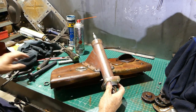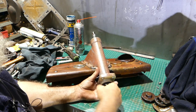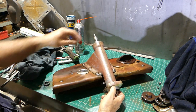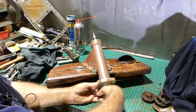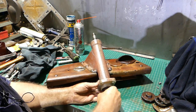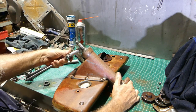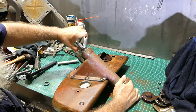With needle roller bearings, once you get them somewhere near where you want them you have to turn them and let them all bed in. That's feeling a bit better — still off to the side a bit. That tin shield might just be touching slightly but it's not a worry. I'm going to hang on to that bottom end and tighten this up a bit tighter than you would think it needs to go.